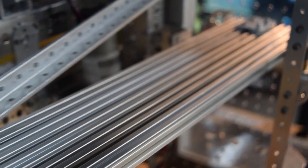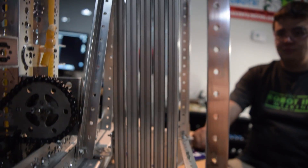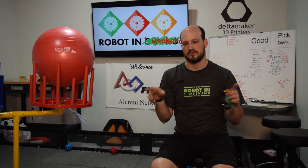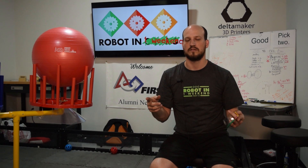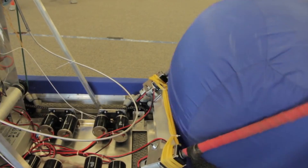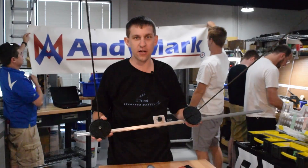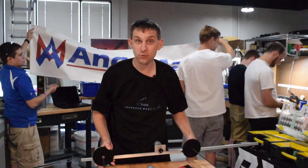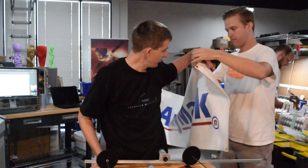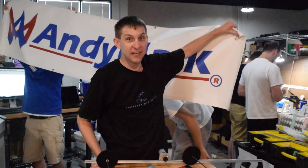On the back side for our lift, we've used Rev Rail again with all the linear slides on it. We've got a push-pull mechanism using another Andy Mark motor and gear set, and we've prototyped a couple of different designs. We have a very simple forklift with a top wheel that could go on it if needed. We've also prototyped our spinning side wheels — we call them El Toro — which we learned from Robot in Three Days the second year. Joe Johnson's team, Boom Dunn, designed that, and we made a miniature version. We just received the big ball and it's a bit bigger than we expected, so we're working on a forklift and another competing mechanism simultaneously.